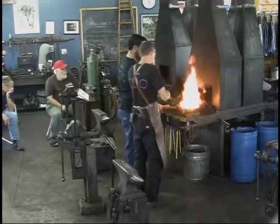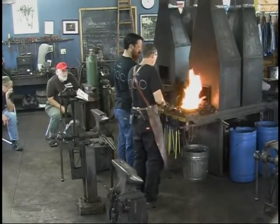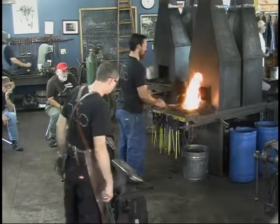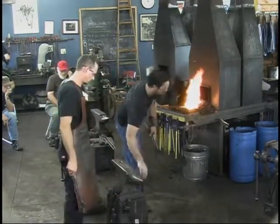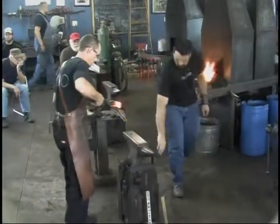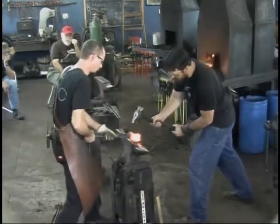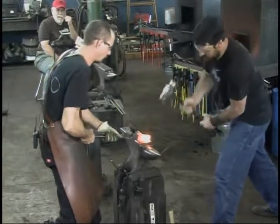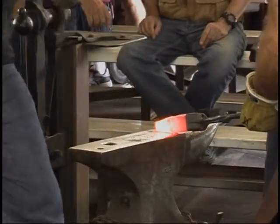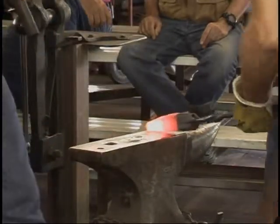So I'm gonna hold this angled on the anvil. If you strike there on that very end, we'll hammer that point down. We'll start by bringing it down on both sides first, and then we'll work it on the square. Okay. Go ahead. Let me flip. Go ahead. Let me flip. Go ahead. Let me flip him. Focus on the very end.